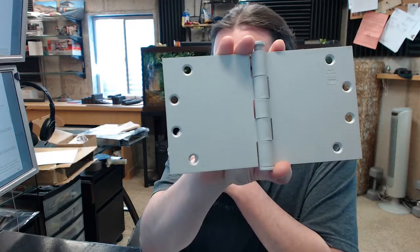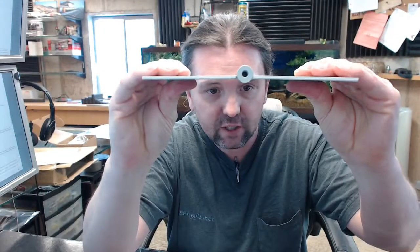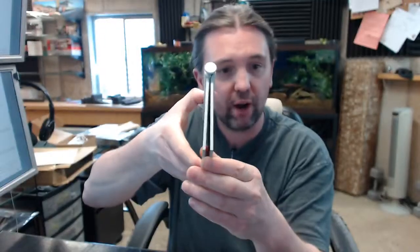Let's dissect the part number first of all. And to do so, let's take a look at the link below this video to a document called Cut Sheet. And that document is handy because it allows us to dissect the part number and also realize what the different derivatives there are of this sort of hinge. And there are plenty. So, first of all, 50 in the part number is going to mean that this is a full mortise hinge. It's going to be a hinge that, as you can see from the swag on the hinge leafs, when the leafs are brought parallel, they're meant to be mortised flush to the edge of the door and frame.